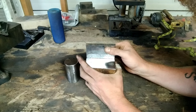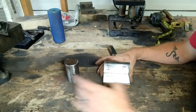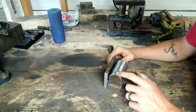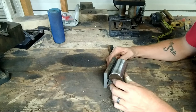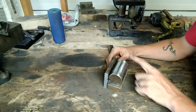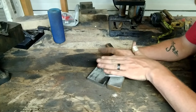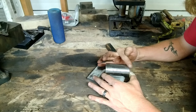It's going to weld on there as a stop. And when that's on there, there's some space between it. But once I flatten this down — this is 4140/4142 solid by the way, three and a half inches of it — I've got to flatten the bottom so it'll sit on there and get a good weld. Then I've got to essentially dome it from this side to that side, because I don't want sharp corners on the fullering tool. When I put the blade on there and hit it, it's going to leave those marks. So the highest point needs to be in the middle — dome it so it's not leaving marks.